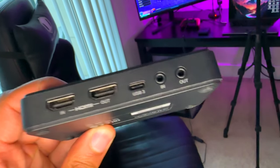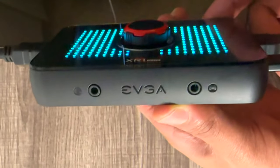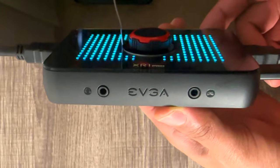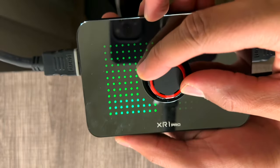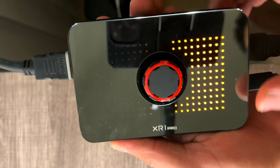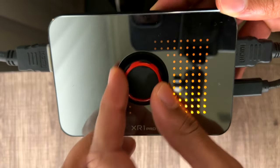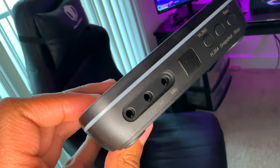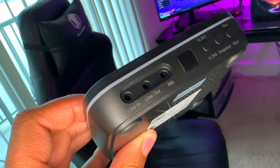That's not going to be the case with the EVGA XR1 Pro or the Avermedia Live Gamer Extreme 3. As soon as you plug a cable like the Elgato Chat Link into one of these line-in connections, the audio will automatically switch to that input instead of over HDMI. The EVGA XR1 Pro even gives you further control of that line-in audio by being able to control the volume using the knob on the top of the capture card. The Cloner Alliance capture card also comes with this port, with the addition of a line-out and a microphone input.